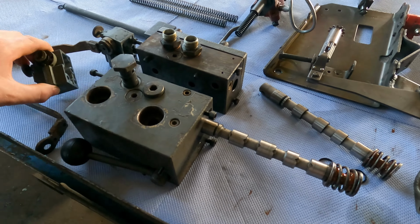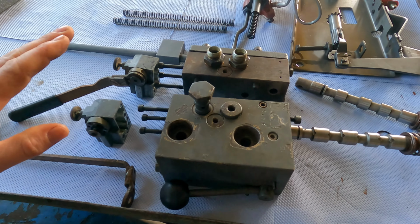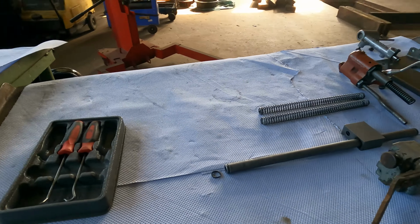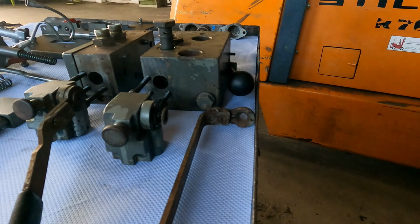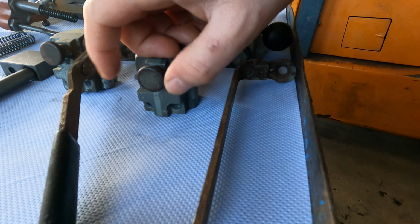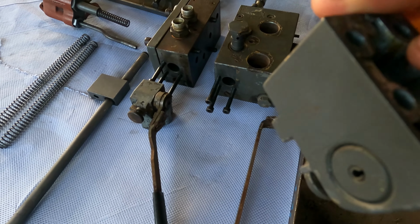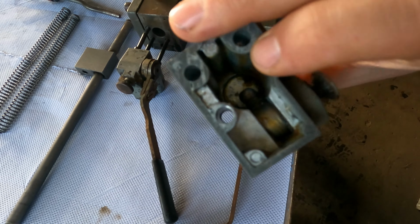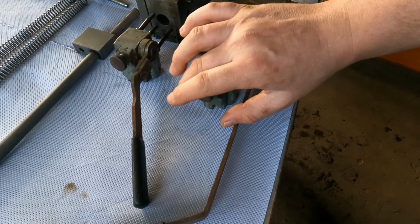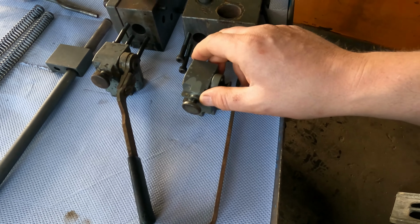If you wanted to use the Till hydraulic valve as a single acting valve, why, I don't know, but then you have to take this screw here and you screw it in, and then it blocks the valve lever from traveling in the one direction. So when this is screwed out, double acting, screwed in, single acting.